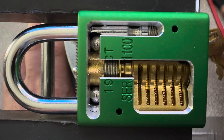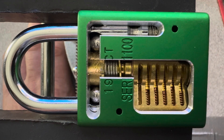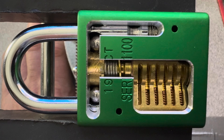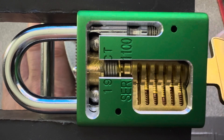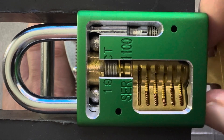Check this out — I have this lock's brother down below with a different key. The bitting — the way the key heights are set on this cutaway lock — the numbers are 7-3-7-4-6. Keep that in mind, because the numbers on this key are 7-8-3-3-8, so it's going to set the pins to a different height and it's not going to work. Some of them are right at first — seven is right — but everything else you can see some are too low, some are too high, and that's what keeps another key from working in your lock.